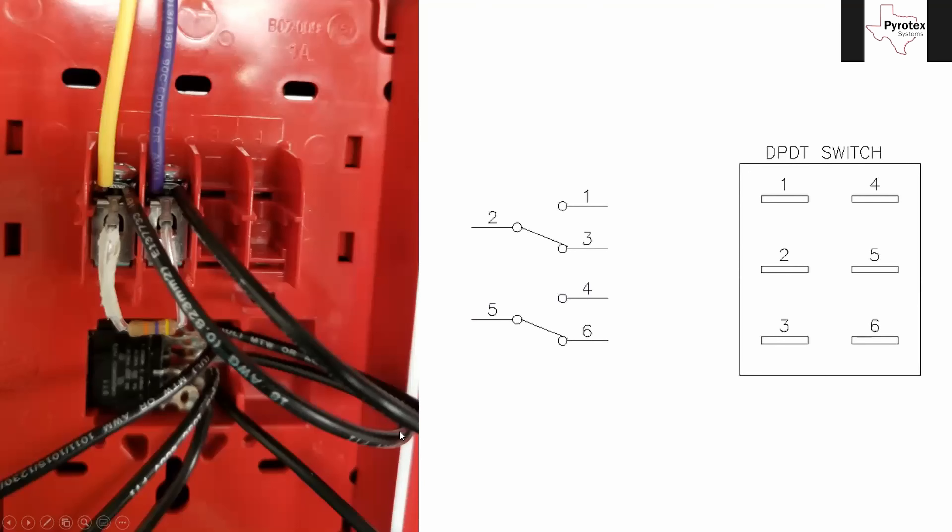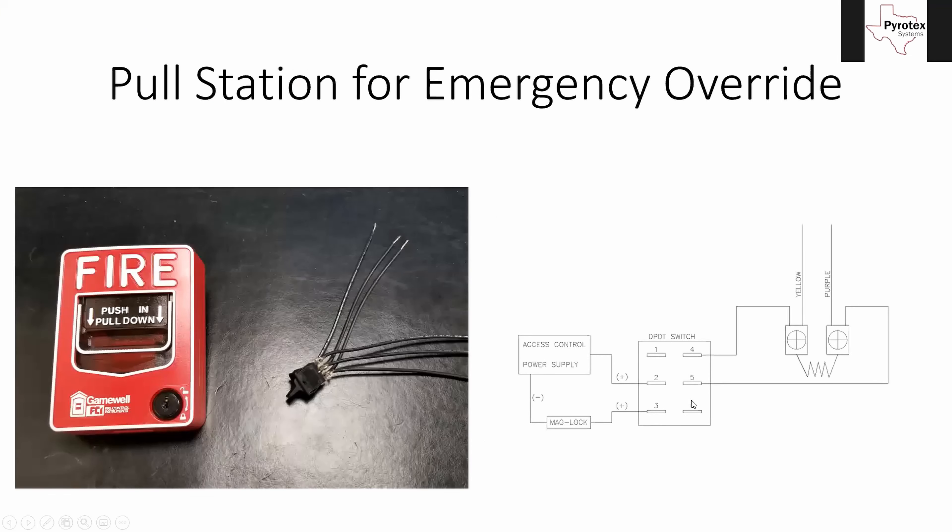Here it is actually wired up. Here's my end-of-line resistor with yellow and purple legs, and here's that switch installed where the other switch goes. These three legs are terminals one, two, and three going to your access control. Terminals four, five, and six are on the other side, with four and five landing under the same screw terminal to go through that switch as described. Important: terminals one and six come pre-built on the switch but have no wires attached — you need to cut each one off and put a wire nut over each separately. Do not tie terminal one to terminal six, as that will connect the two sides of the switch together, and we don't want access control power feeding into our monitor module.